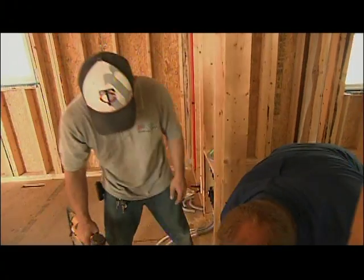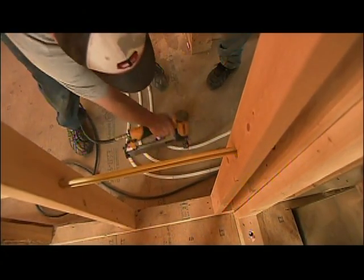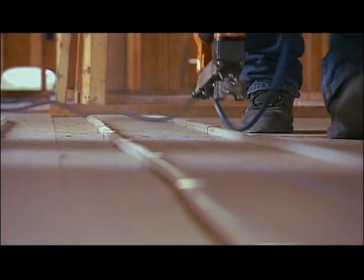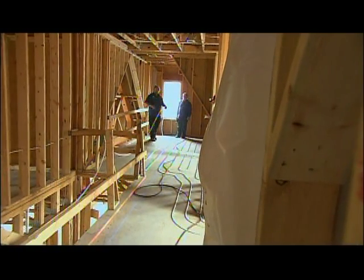This can also be done not only in new construction but also retrofitted for existing homes. There are nice retrofit products — a plywood product that raises the floor height about a half inch, and other products that can go below the joists if it's easier to access the ceiling from below. And of course, you can actually save a lot of money using radiant heat. People are more comfortable at lower temperatures than with conventional air systems, and even that change of a few degrees means energy efficiency and savings for the homeowner.